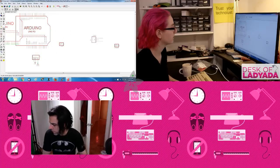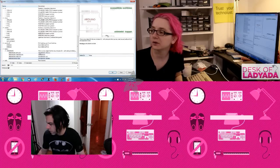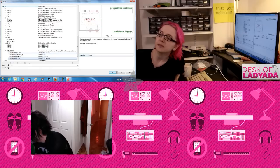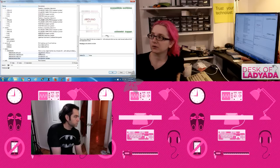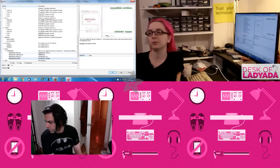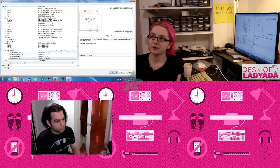Do you use a Raspberry Pi or BeagleBone Black for testing or automation? I have, but it's rare. I try very hard to avoid it because I don't like to involve a computer when not necessary. There are some situations where you really need one. We use a Raspberry Pi because we test the boot. We have to program two chips, so I use the BitBang capability of the Raspberry Pi. We have AVRDude with BitBang capability, so it can program the two chips on board, and then I do enumeration and bootload. I really want to make sure I'm testing USB, and testing USB is more than just enumeration. If you want to test data transfer, which I do because I want to make sure the bootloader bootloads properly, I use a Raspberry Pi for that.